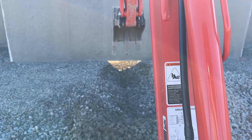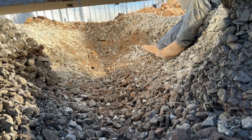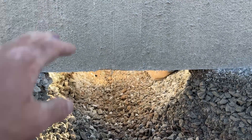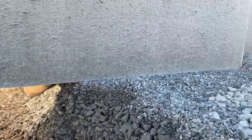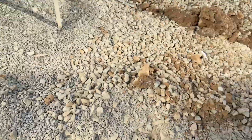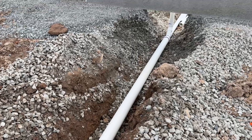We got daylight. We're bringing the waste pipe out to the septic area, so I'm going to dig it out from here and it should be home free. There's our line — I think we'll get a pipe in there and see what the pitch is. When digging through the concrete superior wall, I went right in the middle — it's probably like two and a half feet, you could go five feet without disturbing the wall. I was told don't touch closer than 12 inches off the foundation. We'll dig this out a little more, set some pipe, and we're almost done — 99% done.